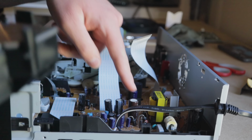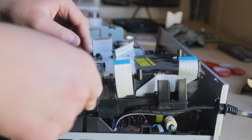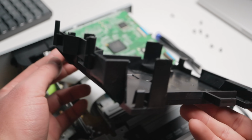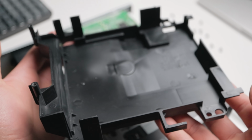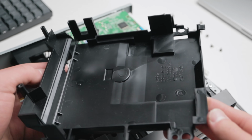These capacitors were a little taller than the originals, which I should have checked beforehand. This made it so I couldn't actually reassemble it. There was a lot of extra plastic below the DVD mechanism, and the power supply is right below that. But I was able to remove the extra plastic, and it worked just fine. I sealed it up, and I didn't have a single extra screw.